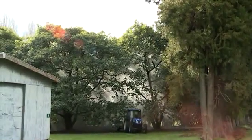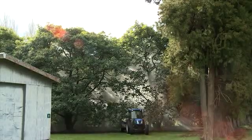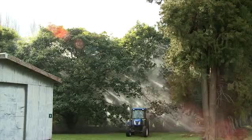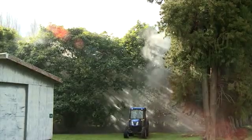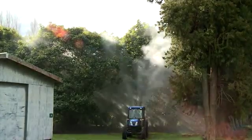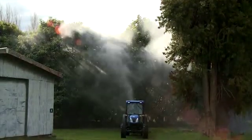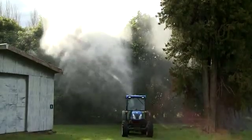We've tuned the fan out to the maximum 45-degree pitch, which is improving the performance quite significantly. In fact we had to upscale to a 100 horsepower tractor to run this fan, which just goes to show how much air it's sucking in and blowing out — we're getting a tremendous amount of air flow, which is helping the spray penetrate the trees.